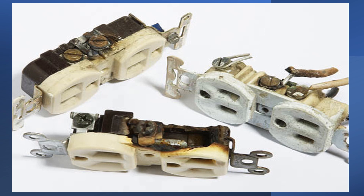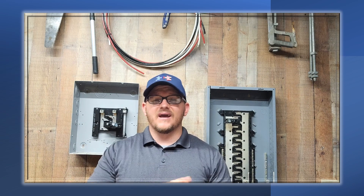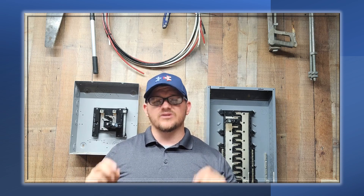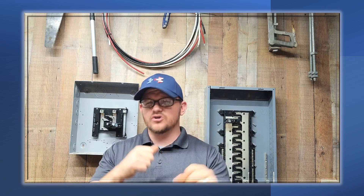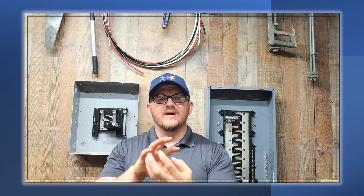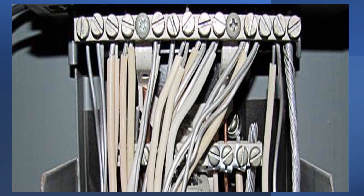Now let's talk about the elephant in the room — aluminum oxidation. Whether you love it or hate it, antioxidant paste works. Some products nowadays claim they don't require it, but the only surefire way to protect aluminum from oxidizing is to use antioxidant paste. The moment you strip that wire, oxygen hits it. Aluminum oxide starts to form — it's a terrible conductor of electricity — creating points of bad connection, which leads to overheating, then expanding and contracting. When terminating to a brass or steel screw without antioxidant paste applied, and with possible dissimilar metals involved, they tried to correct it with copper and aluminum rated lugs — COLR — and we'll cover those fixes tomorrow.